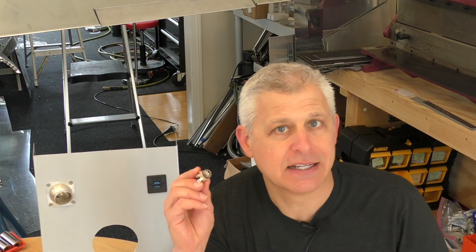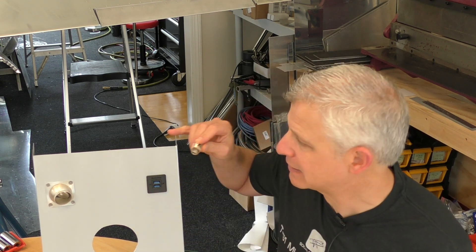That's how you start picking up noise from other parts of the aircraft — things like ignition noise, alternator noise, all sorts of other things you just don't want in your audio. That can be really annoying if you've ever been in a plane where you can hear whining that follows the speed of the engine, or ticking that follows a strobe light. The way we avoid that is by isolating those jacks — so even though the body is metal, it never actually touches the surrounding structure.